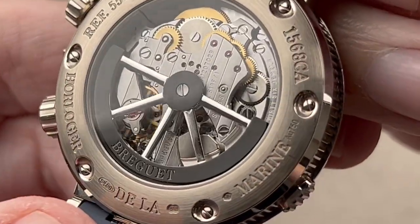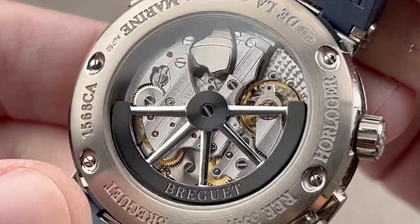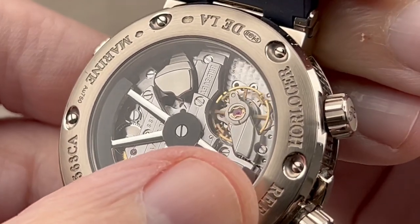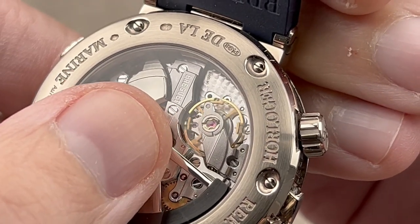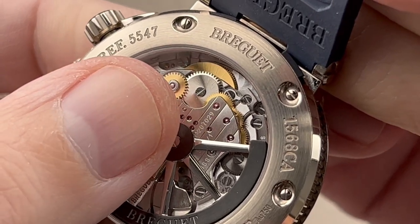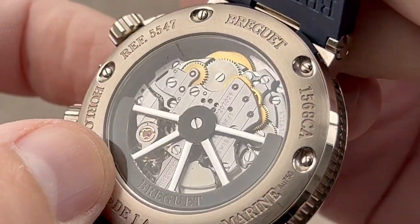The movement, though derived from a Frédéric Piguet caliber designed for Blancpain, is finished to Breguet standards. You can see that the striker features satination on top and mirrored beveling on the edge of each of its lobes. We have stripes across the bridges, engine turning — beautifully tight and symmetrical — across the base plate. A free-sprung balance and a balance wheel with a recessed set of bolts for aerodynamic optimization, then a silicon anti-magnetic hairspring. Wheels feature satination; the ratchet wheel and barrel beneath it show solarization. The beveling on the bridges is quite nice, as is the polishing of the screw heads.